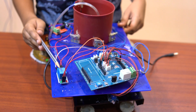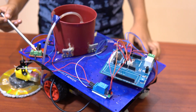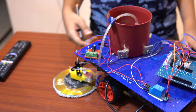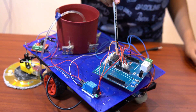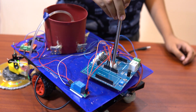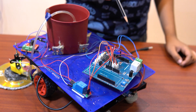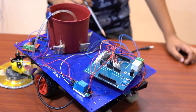These are my motor cables and my water motor cables which are connected to the relay, which will keep on switching between the water motor and the mopping systems. Coming to the power supply board, I have taken the negatives of the devices since the negatives cannot be connected to the relay directly. These are my sensor wires connected to the sensor ports at A0, A1, and A2. These are my digital pins to which I have connected my relay, and these are my motor pins to which I have connected my moving motors.